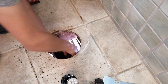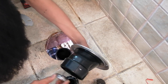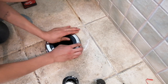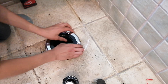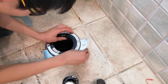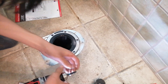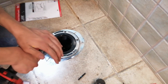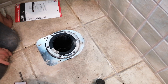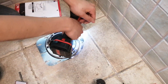The hole in the tile was cut too big by the original installer, so I'm using a support bracket made of stamped steel and also an offset toilet flange just to make everything fit. This type of flange is a bit tricky to install — the pipe must be cut to the right length and must be relatively flat, though a slight tilt can be fixed using toilet shims. I screwed down the toilet flange support bracket to the subfloor by drilling holes through the tile but not into the subfloor, then screwing the bracket in. This should be very secure.